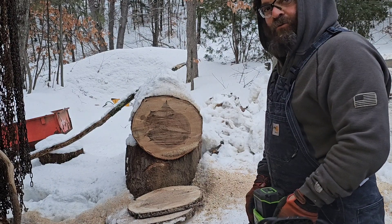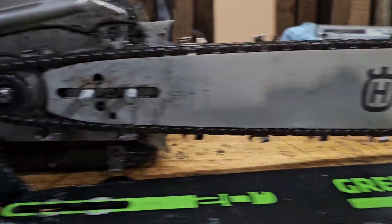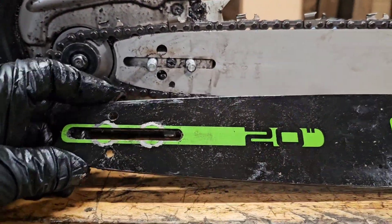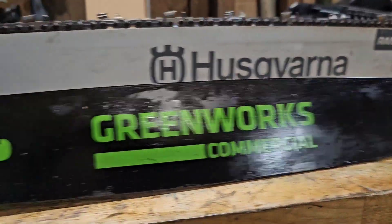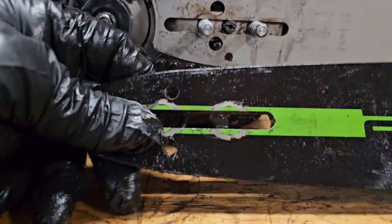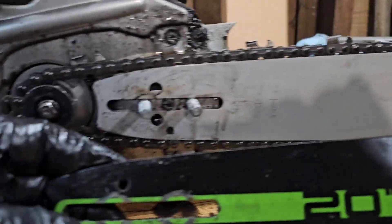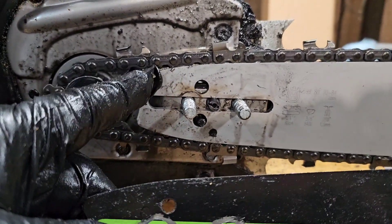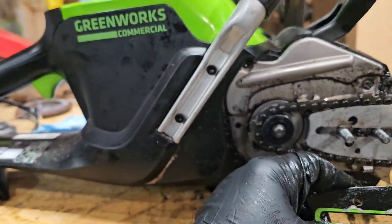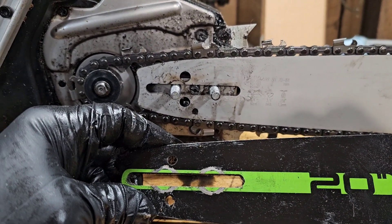I think we've made some headway here folks. So, how I got this 24 inch rancher bar on the Greenworks commercial was — this is a KO-41 Oregon bar, but it only comes in 20 inch. That's as big as it comes with this tailstock style. This is the KO-95. This came with the rancher — it's also an Oregon bar or an Oregon bar style.